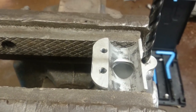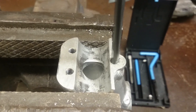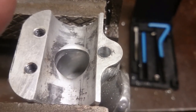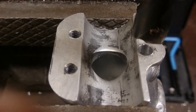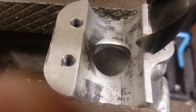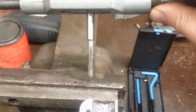If you wander off at an angle, when you put the helicoil in it won't be strong. You need to clean the old threads out ready for tapping. If you have a burr on the face like I have, you can clean this off with a large drill. As it's only aluminium, you can just turn this large drill in the hole by hand, just to clean the burr off and to give you a lead for your tap.